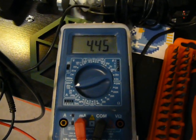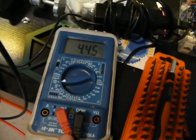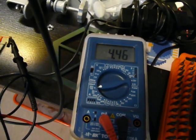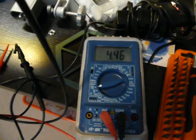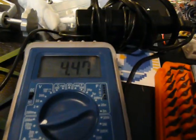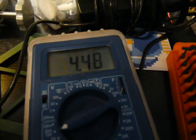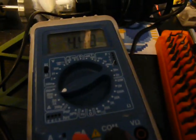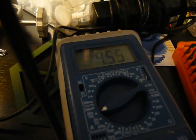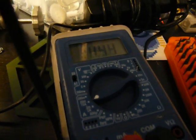For those preferring a multimeter-based approach, I've put my multimeter in series with the transducer and the resistor, and we're reading a few milliamps. That surprised me a bit since I thought zero pressure would be 4 milliamps exactly. But if I blow into it quite hard, you can see the reading goes up — so I think we're good to go.